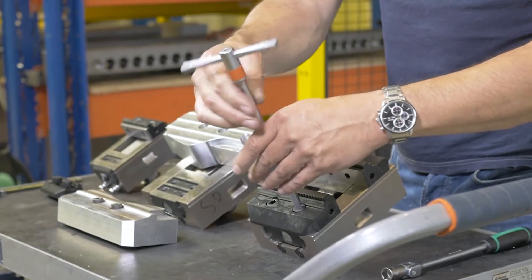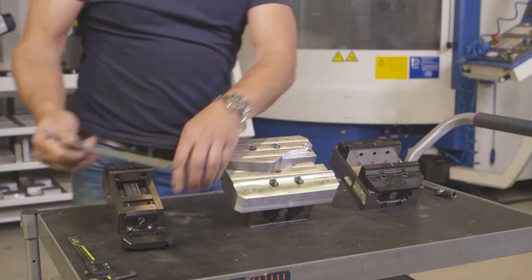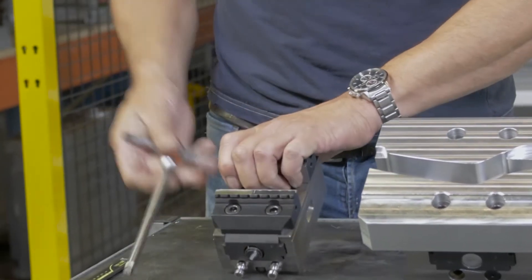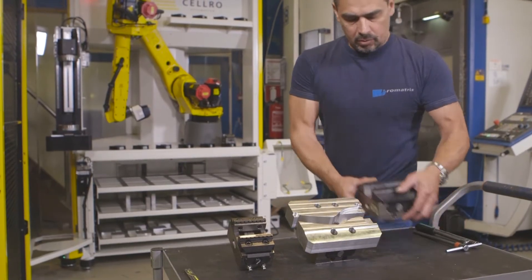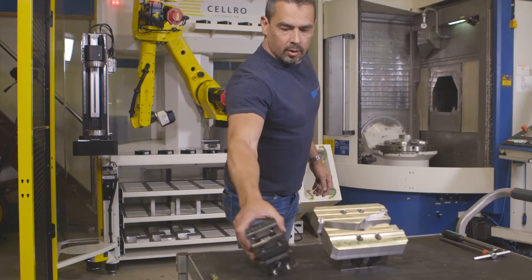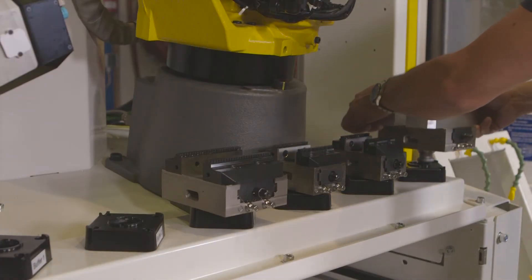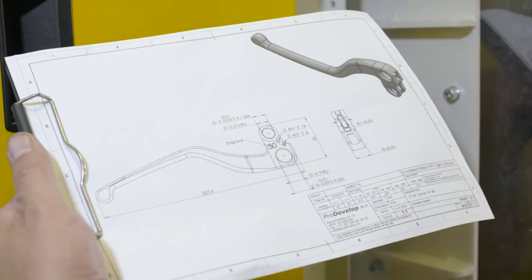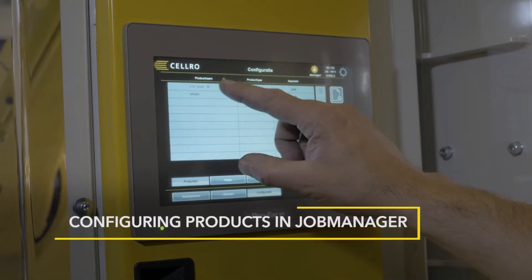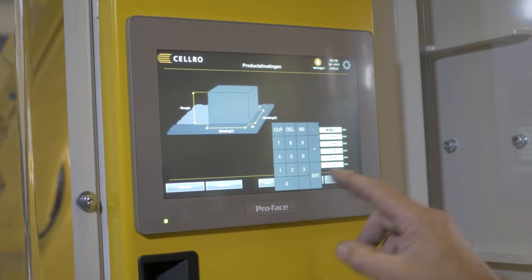The more flexible you are on your clamping systems, the more hours you can make without interfering. Here the specific jaws are being prepared for the pieces we will demonstrate. As stated, two versions: 80 millimeter width and 125 millimeter width, both with a reach of 226 millimeter maximum product size, and you are free to do whatever jaws you want. Here you see the programming of the job manager — configuring it's the recipe to combine the piece with all necessary items.